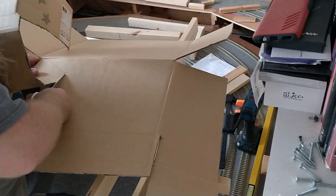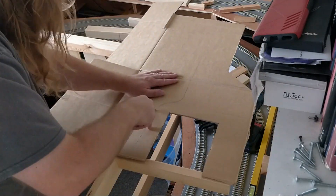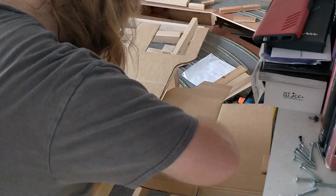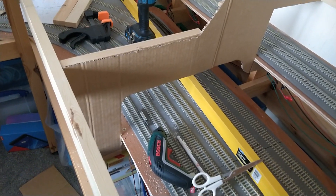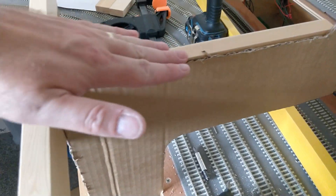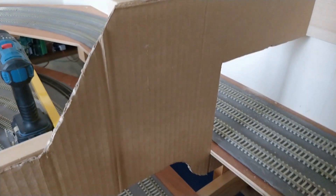The shape of the required piece of ply is not straightforward. Time for some cardboard-aided design! I'm cutting a template out using an old moving box. I've got a basic idea of what this piece needs to look like, but the exact distances and clearances aren't known yet, so the first cutout will be a rough estimate. I can put the template in place on the layout and test its fitment. I can adjust the template really easily with a pair of scissors or a knife, and if I cut away too much I can add bits back on. Old cardboard boxes are effectively free; fresh sheets of ply are not.